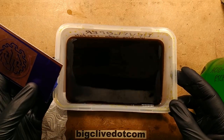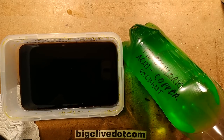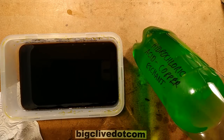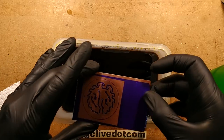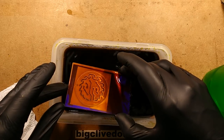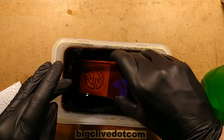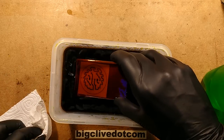The etchant I'm going to be using is ferric chloride — one of the messier etchants. I have been experimenting recently with copper concrete cleaner by Bostick from the local building yard, but when I tried etching a circuit board in it, it didn't seem to be etching very quickly and then all the etch resist came off instead, so that's not ideal. So I'm using the traditional ferric chloride — notice how shiny the copper is. I'm going to just dip it in and notice how it's instantly tarnished — not shiny anymore — and starting to etch. This is the point you'll see if there are any excessively shiny bits where it's not going to etch perfectly.